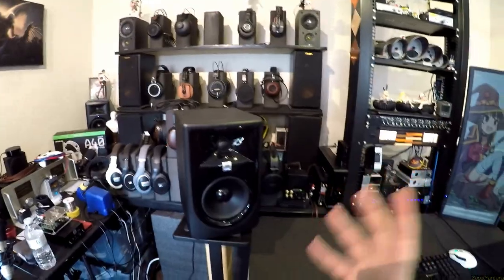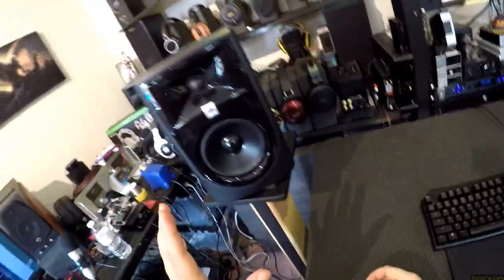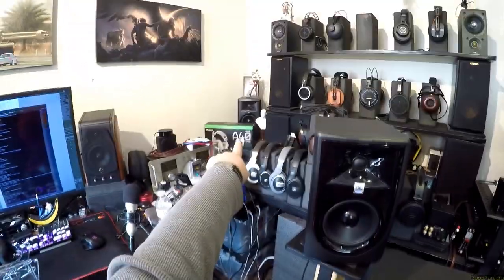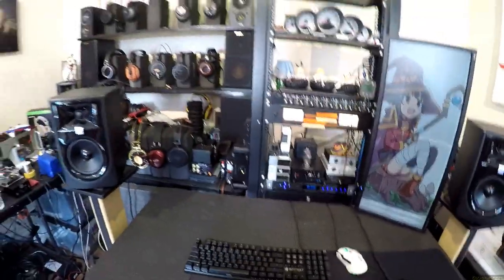So that's an improvement that people have proven on the old set was required. I mean, not required. Everyone loved them without that, but if you wanted that little bit more performance, you basically disassembled your whole speaker and started squeezing hot glue. You found a hot glue thread on 4chan, and then you got completely confused because why isn't everyone just filling their speakers with hot glue? That's what people were doing, and that's what these are doing by default. So you've got a fully dampened fascia now. The waveguide is a little bit better around the driver as well, because again, that has a plate with screws, and then it's a separate piece. This is one continuous roll. Okay. Power's comparable, connections are comparable, price is comparable. How do they sound?